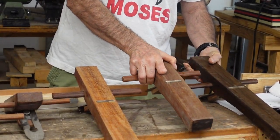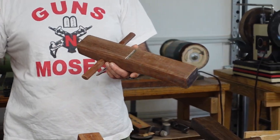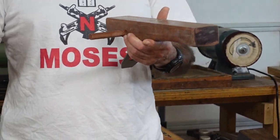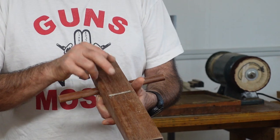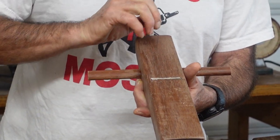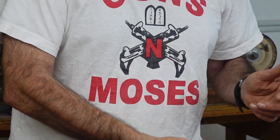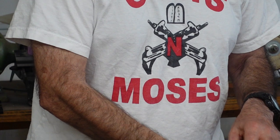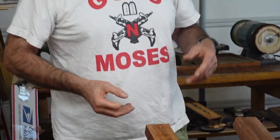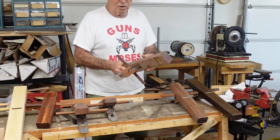Here's another little plane that I use — I would call it a smooth jack plane — because if you look closely, it's got a very small opening in the mouth. So I use it to make very, very small shavings for finished cuts. Or you can use it on a little side angle for shooting a board and cutting it that way.